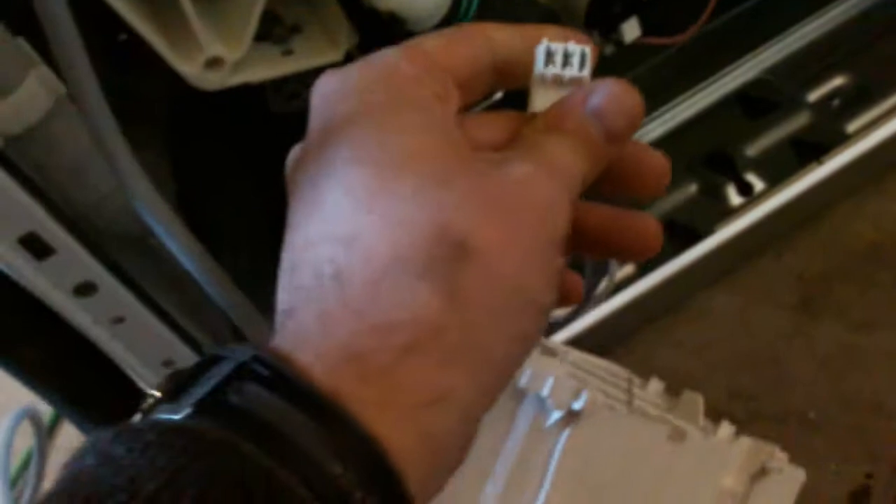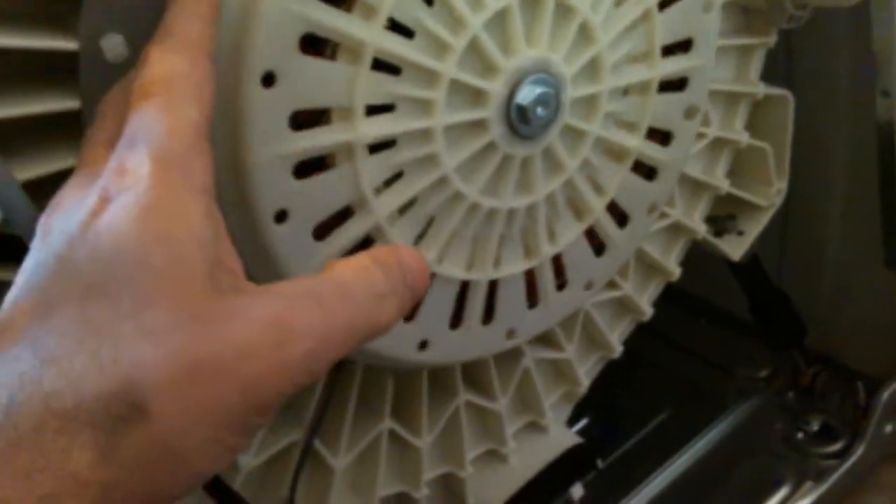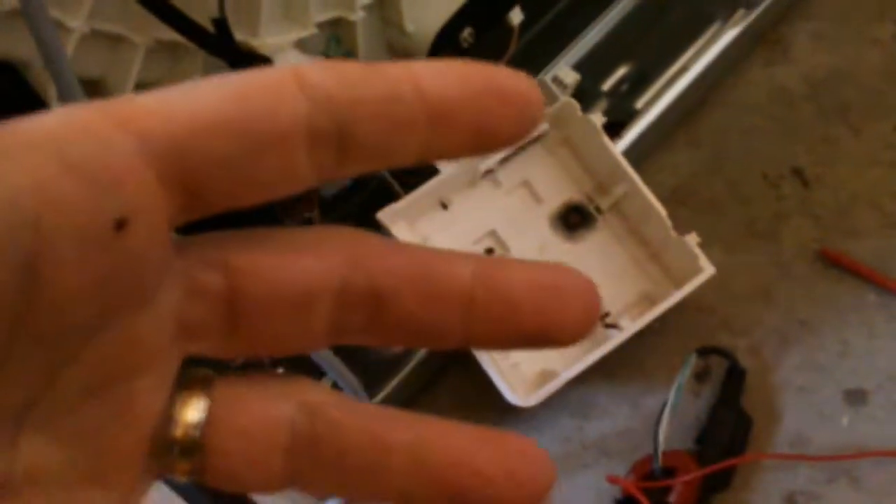What was really cool was this direct drive motor right here — really sparked my interest. Self-contained, built-in heavy-duty mounting bracket, awesome bearing assembly. This thing will just make an outstanding generator. If we hook a multimeter up to it, we'll see we get out probably about 30 volts. I believe it's a three-phase generator. Turning to generate voltage is probably 60 revolutions per minute, which will equal about 30 volts AC. You can hook up a full wave bridge rectifier to that and get some DC out of it.